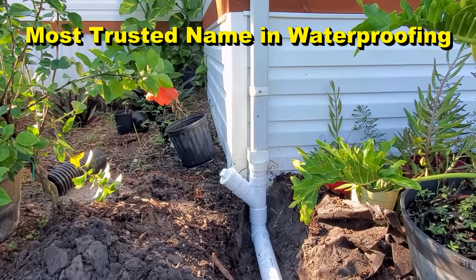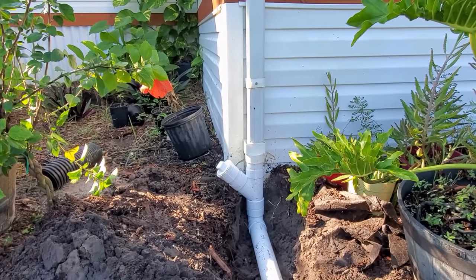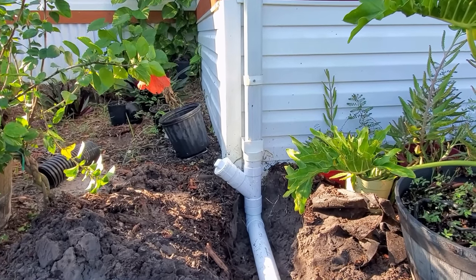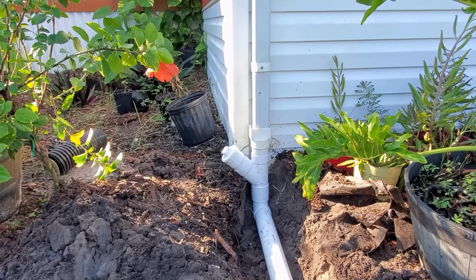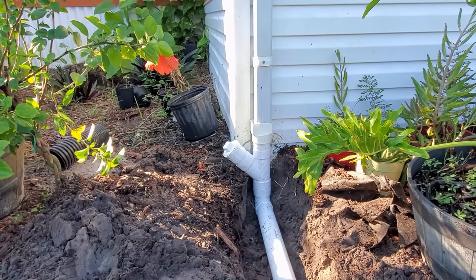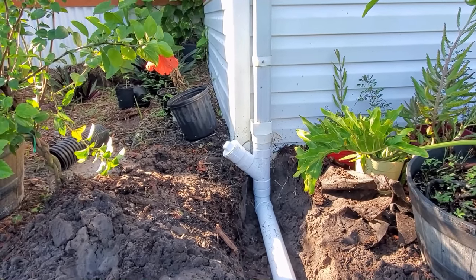Okay, using PVC, you can see we've got a downspout adapter. Then we've got a Y that holds the clean out. There's a clean out assembly with a cap so that if that line backs up, you're able to send a cable down through there and clean that line. Maintenance is very important. People say PVC never gets roots. Believe me, been doing this 30 years and it can get roots and it can collapse. All these things are possible.